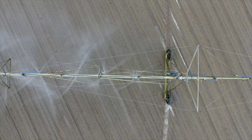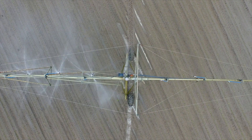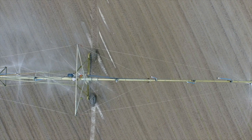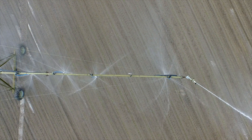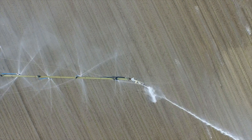A sandy part of the field will dry out more frequently than a part of the field that has heavier soils. A variable rate irrigation system takes these different zones, delineated using different techniques, and applies a proper amount of water to those zones. An irrigation management zone is developed based on a layer of data collected from that field — that could be yield data, field history, elevation, soil texture, or soil type — combined together to create differences in that field.